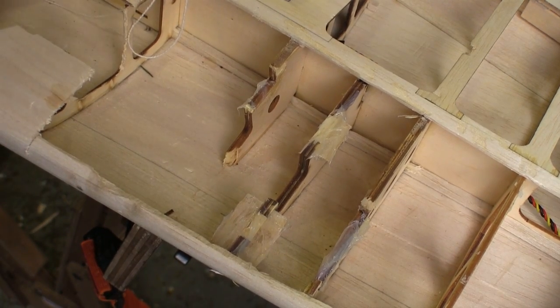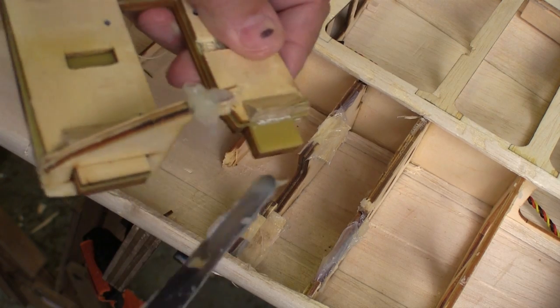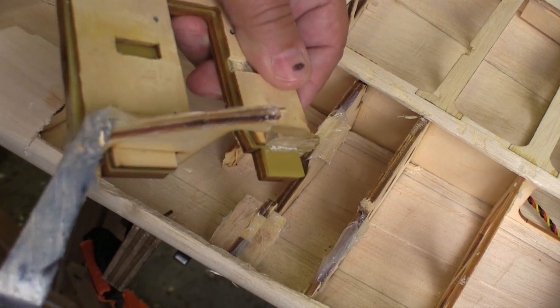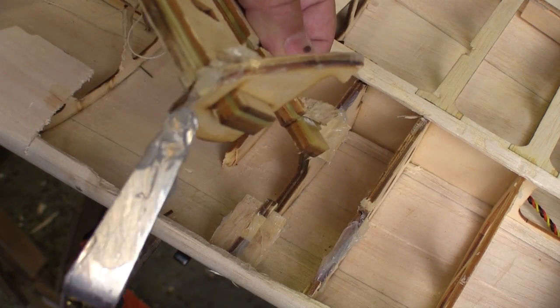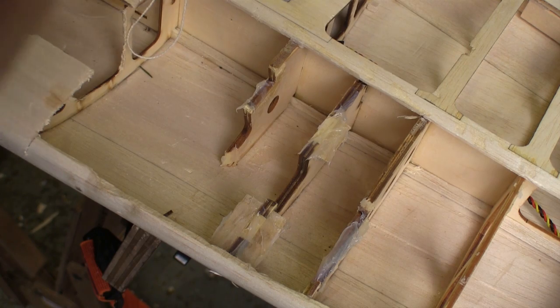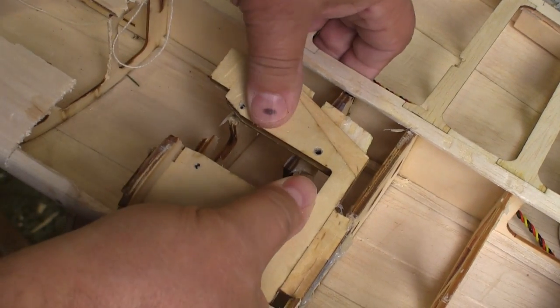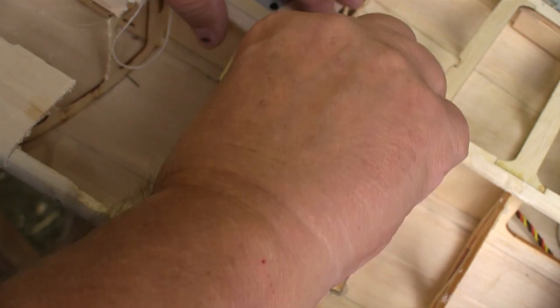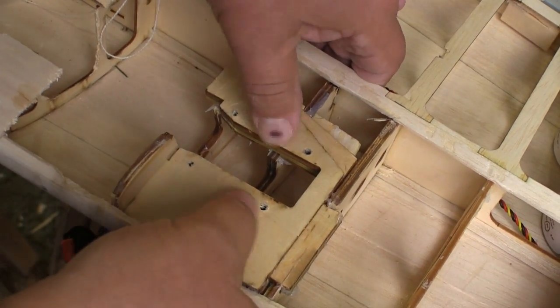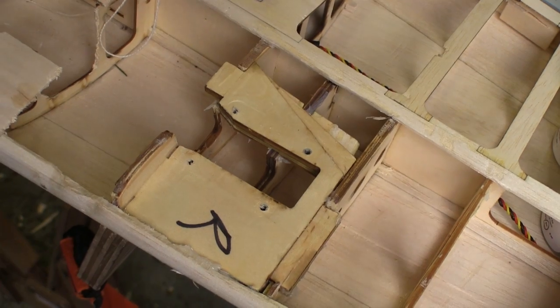I'll spread a coat on all the contact areas of the piece that we're putting back in here. The consistency of this epoxy and the palette knife make it really easy to apply and have it stay where you want it. After I spread epoxy on all of the contact areas I can put the piece back in place. Like any joint, if you want it to be strong it has to fit very well, and I took my time fixing this piece so it clicked back into place the way it's supposed to. We can't count on any adhesive to make a strong joint if it's bridging unnecessary gaps.